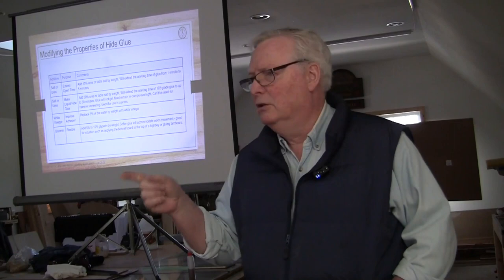So what I did to figure it out was I simply took some hide glue in a standard batch. I added 5% by weight of salt. I cooked it, I waited to the next day and tried to make it liquid, and not so much. 10%, 15%, 20%. When I hit 25% it started to kind of act like liquid hide glue. At 30% it did act like liquid hide glue. So my point is, empirically, 192 gram strength using that particular hide glue, 30% salt. If you get it from a different manufacturer or you're using a different gram strength, you'll have to do a little experimenting and figure it out. But once you figure it out, you've got the number.